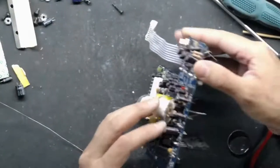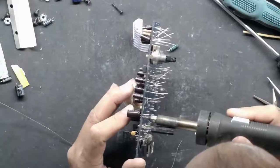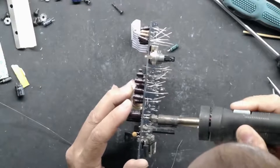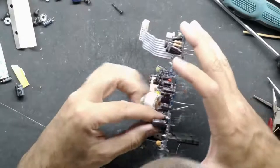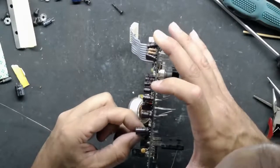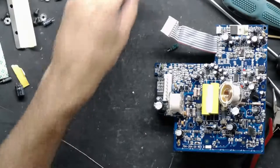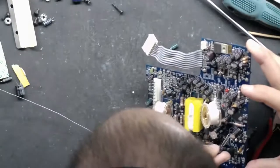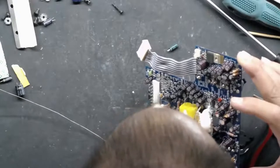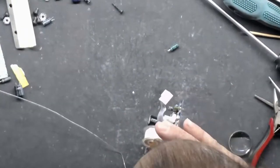Keep jamming away — only a few more to go here. 10 microfarad at 100 volts — that's another Sunfire exclusive. I make sure I keep those ready to rock. And then these large ones — I think these are 47uF at 200 or 250 volts. Those are also Sunfire exclusives, for the main power rails. The bus voltage on these is plus or minus 160 volts, maybe a little less on the Super Juniors. These are 250-volt rated — pretty big caps.